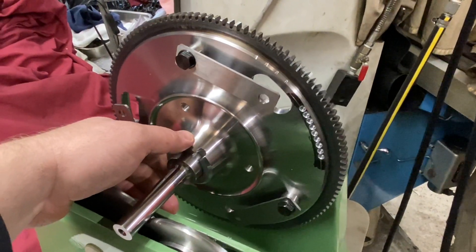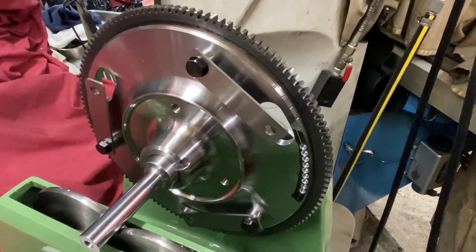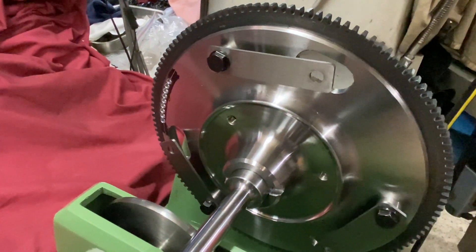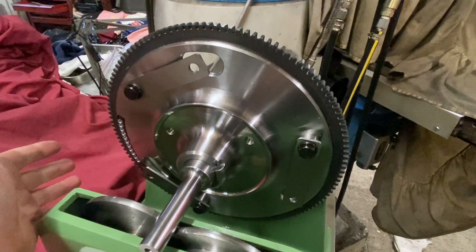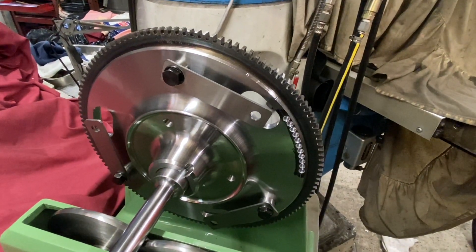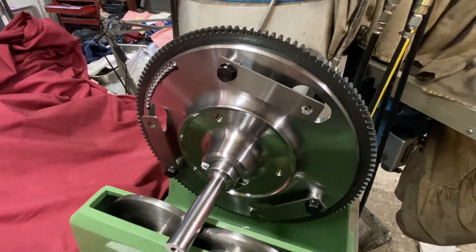As you drill, you need to regularly keep checking your progress. I've drilled quite a few holes there now, doing a few holes and then bringing it back to the jig to keep checking. As you can see that's still falling — we bring it round to the other side and it's still falling. So we've got a little bit more to go yet. After two more holes added, we're finally finished. I just had to do two part holes — one there and one at the end. And then we've actually got something that balances out. So that's ready to move on to the next point, which is to put the back plate on and then we'll balance that.